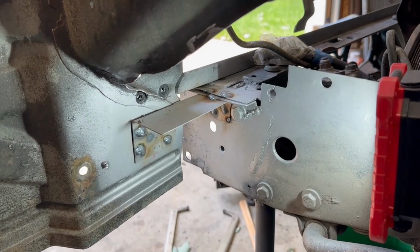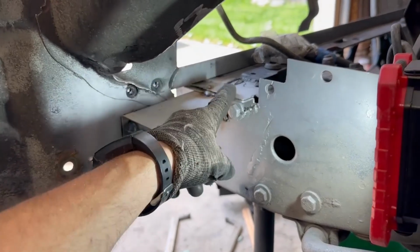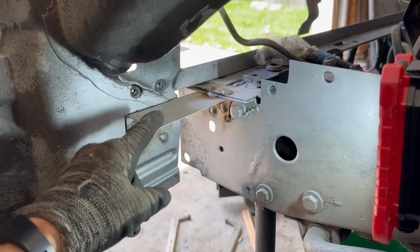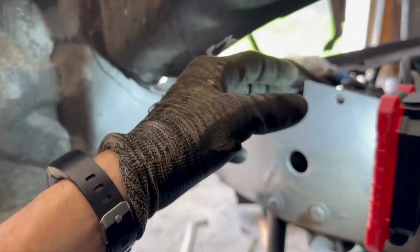That bracket's all welded in. I pulled the bolts. I'm going to grind this upper lip material out of there, and I'm going to make another bracket that folds up and cinches down on this side. So give me a lot more strength in this area. It's 16 gauge, it'll stay nice and strong. I'm going to grind that, make the bracket, weld it in, and then I'm going to start cleaning this edge up and get the other brackets in here.